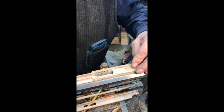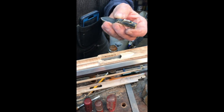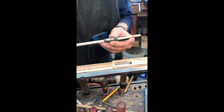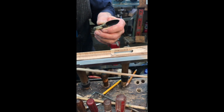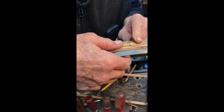Well, the only way we can get that down any deeper would be to take a little bit more off of that stud there, because it is touching on the barrel now. Let me just take another couple of thousandths. Oh, all right, now we've got the thimble all inlet. There's enough clearance, and it's good and tight without being too tight. And the loading stick, as you can see, goes all the way in. Now, we want the stick to be able to go in with the thimble in. We can't get the thimble in any deeper. It is right up against the barrel now.